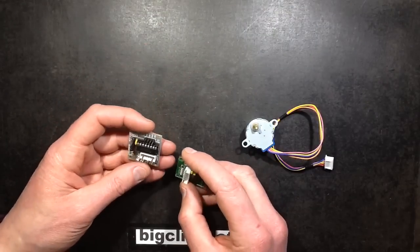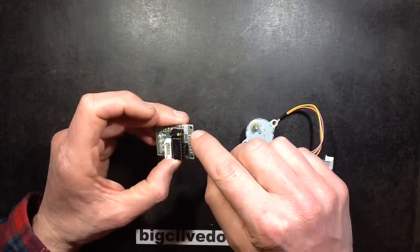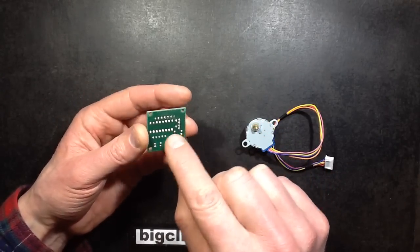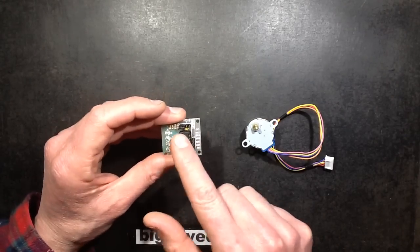You can change the chip if you have a little incident. The input pins — they've put all 7 input pin holes on it, so you could add another 3 pins and just tack leads on. You could use this to drive up to 7 loads; you'd only have LED indication for them, but you could do that.